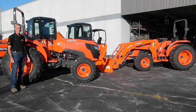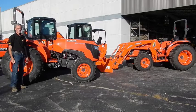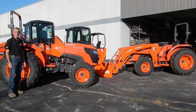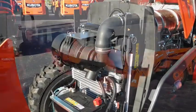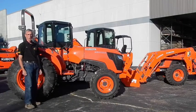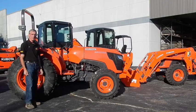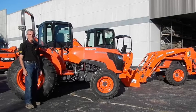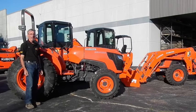What we're talking about today is our MX 5200 Series Kubota Tractor. It's a 54.7 horsepower tractor, available in either two-wheel drive or four-wheel drive. It is equipped with either a hydrostatic transmission with three ranges, or it's available with a standard transmission — a four-speed manual with a high-low and a synchronized shuttle shift.